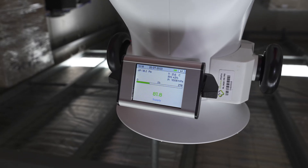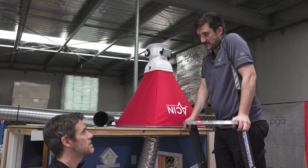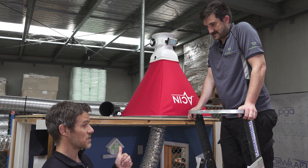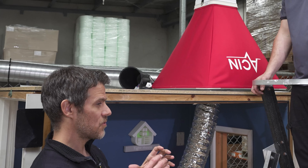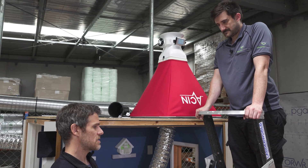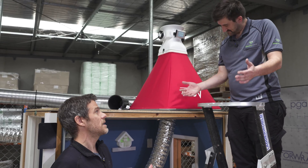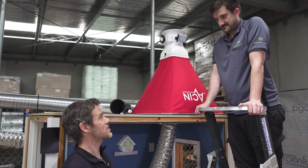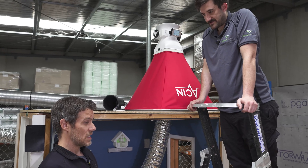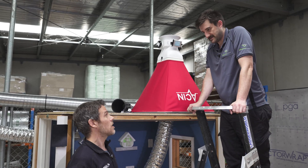You might figure 81 still sounds like quite a lot of flow, but this is with a very good fan pumping hard. There's only so much that the fan can do to compensate — you're just going to restrict the amount of free area it can push air through. A lot of homeowners move into a house and just say that fan's never worked very well in the bathroom, and no one ever knows why. But when you crawl around in roof spaces you find crimped ducts, disconnects, things that have been bunched up, smashed, ripped. If no one ever checks these things or measures at time of completion, you don't know what you're getting.